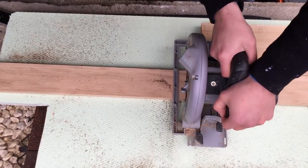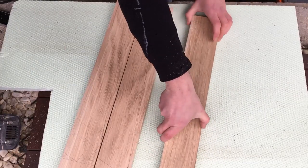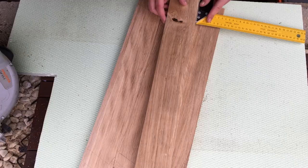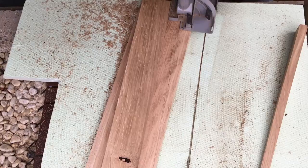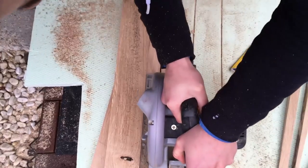I'm cutting all the longer sides with the handheld circular saw because they were too big for the miter saw. I calculated a guideline by measuring from the edge to the saw blade, so I got the cut exactly where I wanted it to be.